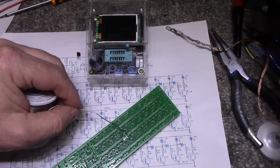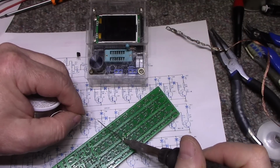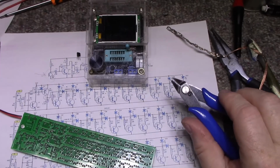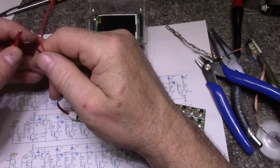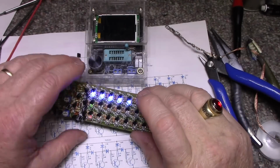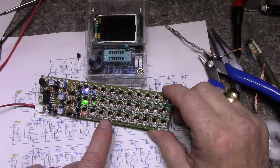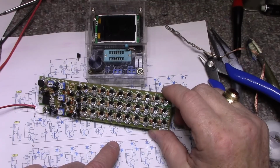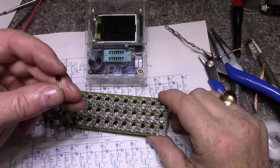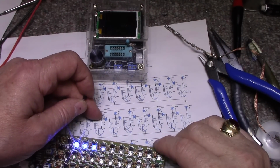So I'm replacing it with a new transistor, because I had extras. Alright. Seems to be working now. We don't have any more phantom light on green. Hello? Hello? It's working. I wonder if this transistor was bad. But the other 2 beside it were lighting up as well, so maybe it was back feeding current. It's not possible. It can't happen that way. The diode would block it. It is weird. It's working now.